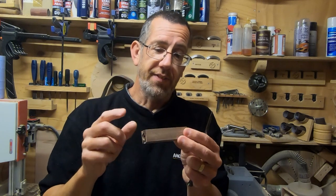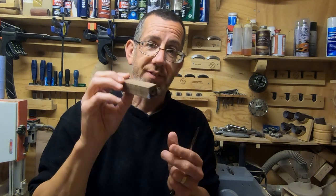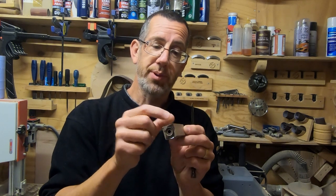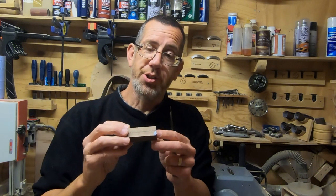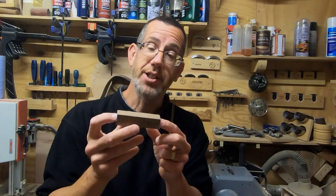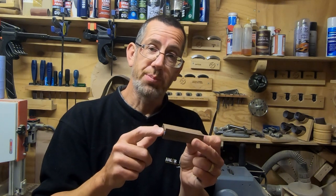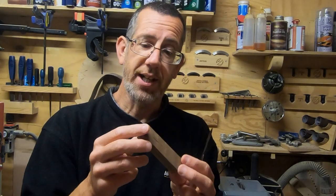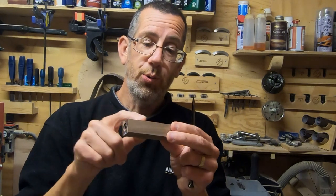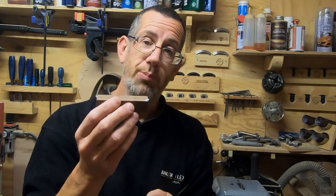The way I've done this is I've actually just cut the brass tube in half. I've still drilled a hole all the way through the blank as if it's an ordinary pen blank, but what I've done is I've just glued the ends of the brass tube in at each end. The only reason you've got the brass tube in here is, one, obviously for if you've got it on a mandrel or turning between centres, to actually locate the blank to stay central. Then you can actually just take your blank down to the size of the bushings on the end. The only other reason for the actual brass tube is to push in these fittings on the end. So all the space that's in the middle there is just wasted space. It's just not used for anything. So it doesn't make a difference. You could make your blank as long as you like.